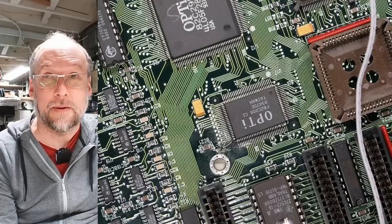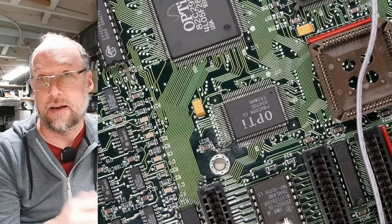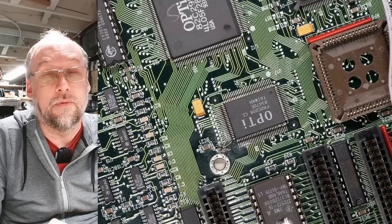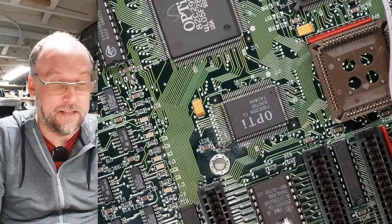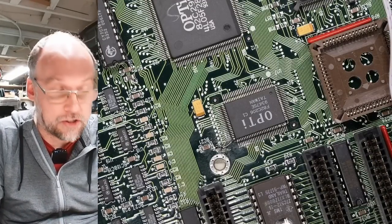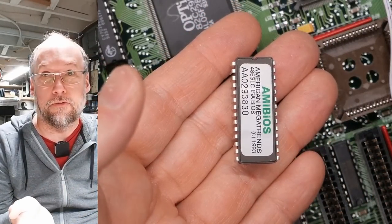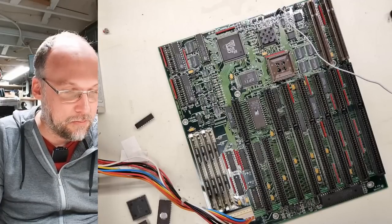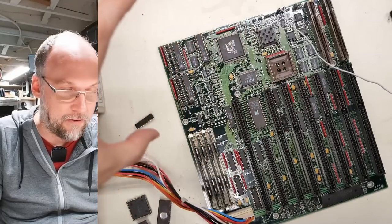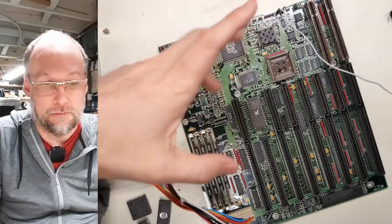It's really unfortunate I didn't inspect the board first and catch that lifted pin, but if that power supply was going to die it would have died anyway. It's always a worry with old power supplies—they could go bad and maybe put out too high a voltage and damage things. The EEPROM still works but doesn't read properly, which is weird. I can't test much else since everything is soldered. Whatever handles reset on this board has been damaged—probably the chipset, although the CPU could have gone bad as well.